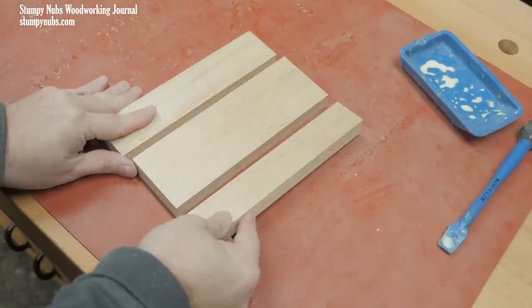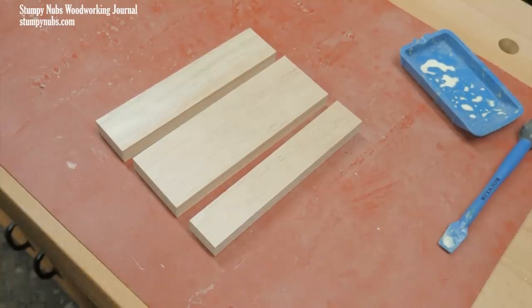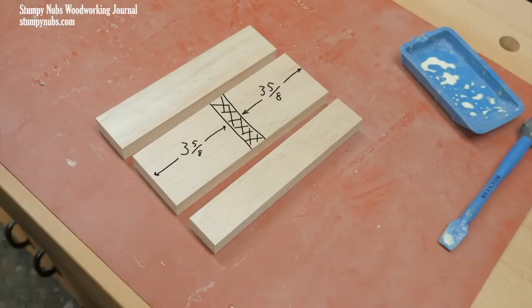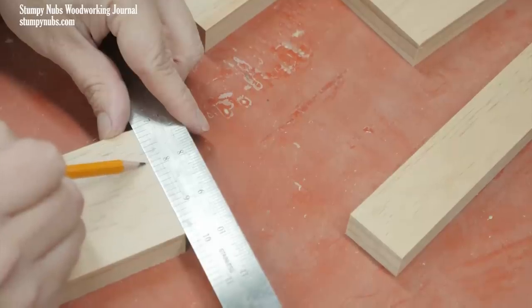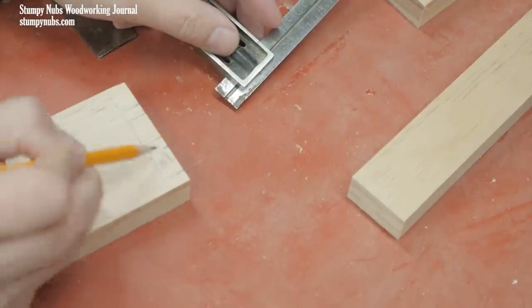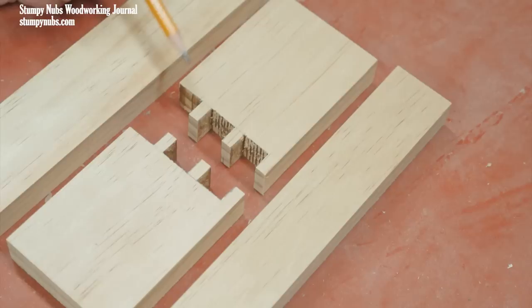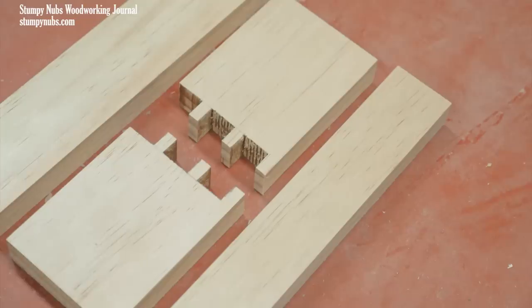The right piece should be around an inch and a half — if it's a little wider, we'll trim it to final size later. The reason we made the door panel as a single piece and then cut it into three pieces is so that when you glue it back together, it will look like a single piece again with continuous wood grain. Take the centerpiece and cut it into two pieces, measuring three and five-eighths of an inch down from each end — discard whatever remains in the middle. Then measure from the left edge of the lower piece: five-eighths, a quarter, five-eighths, another quarter, another five-eighths, and you should be left with a final quarter. Carry those lines down the face three-eighths of an inch from the end and cut away the wider portions, leaving the narrow tabs between them. The upper half gets a similar treatment so the two are mirror images of each other.